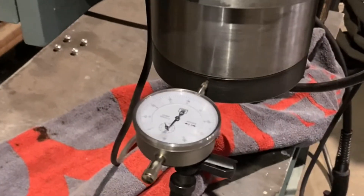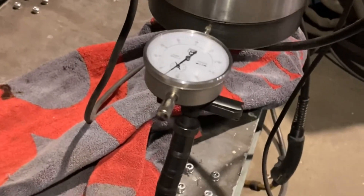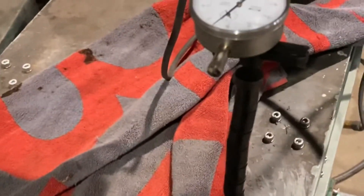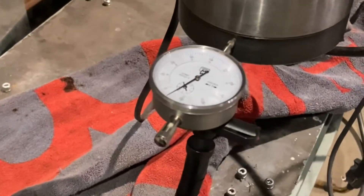So after putting those stiffener plates in, I managed to get it down to about half a millimeter, just over. There's a fair bit of play in the table too, so that's not tight yet. Probably a bit less than that, but hopefully you don't get too much vibration — we'll see how we go.